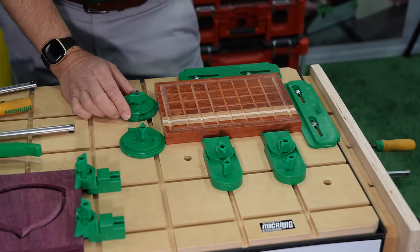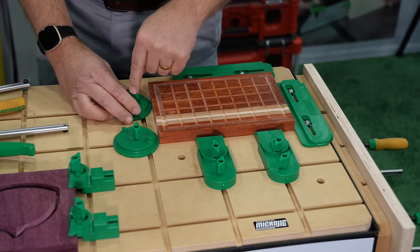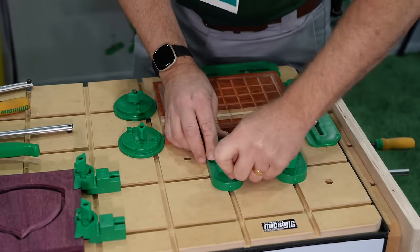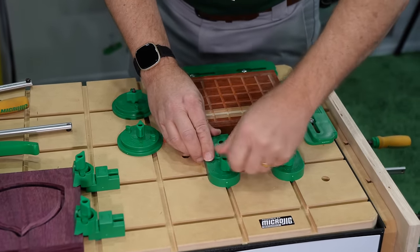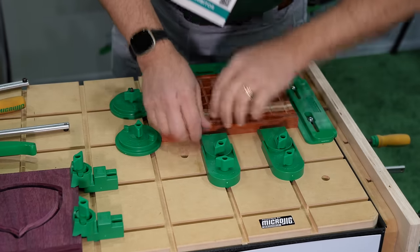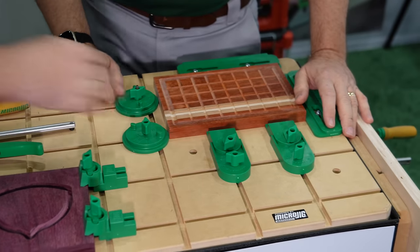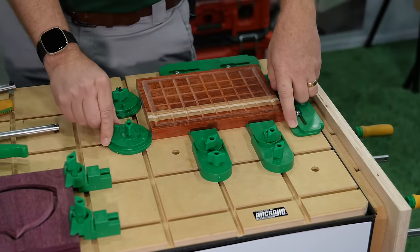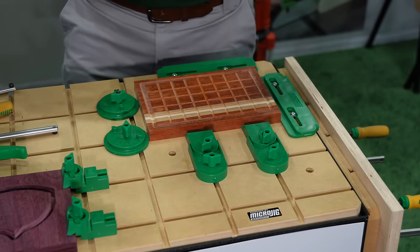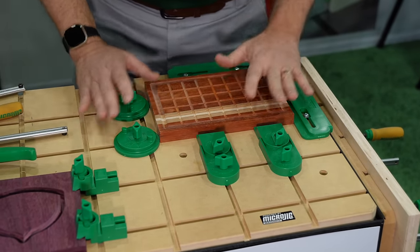There are two different side clamps. One is an eccentric cam with a center hub that doesn't move, so when tightening or loosening it's not loosening the knob. They also have a traditional toe clamp that moves in and out; once positioned, you lock it in place. A series of ramps tightens the knob and brings the clamp forward against the part. It also has a V-groove so it works on corners. All the lips are beveled back and downward so any pressure folds the part down into the table rather than popping it up.